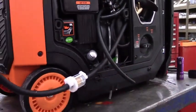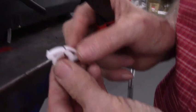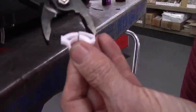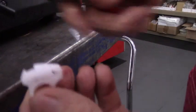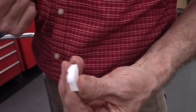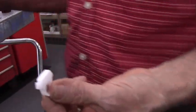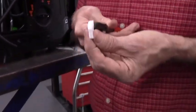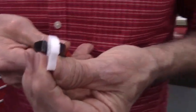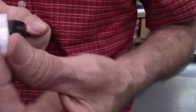Here's how to use the clamps — this works for both large and small ones. Put it around the hose and squeeze together. If they squeeze together a little crooked, take a pair of pliers and squeeze side to side to line it up. If you need to remove one of the clamps, grip on one side and push on the other side — it opens right up.